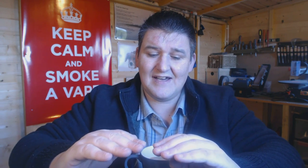So ideally, what you're trying to do is you have your piece of metal and it has scratches in it. You want to get down to the level of the scratches and smooth it out. Now, if you go too hard with 50 grit, you can go right down and make a mess. And then you're going to have to spend a lot of time smoothing it out with a higher grade of sandpaper. It'll make sense in a minute. I'll show you in a minute. But that's 10 minutes of waffling, and we'll stop there and we'll get some visual stuff.